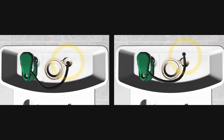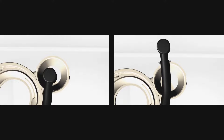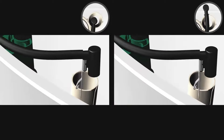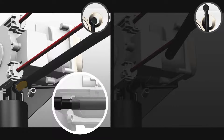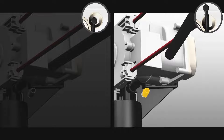For tanks that use a refill tube, check the installation position of the refill tube on the overflow tube, then disconnect it. Trim about three-quarter inch from the tip of the refill tube and discard the tip. On the auto flush unit, locate the black inside overflow nipple and the white outside overflow nipple. If the refill tube tip was located on the inside of the overflow tube, connect the refill tube to the black nipple. If it was on the outside, connect it to the white nipple on the auto flush unit.